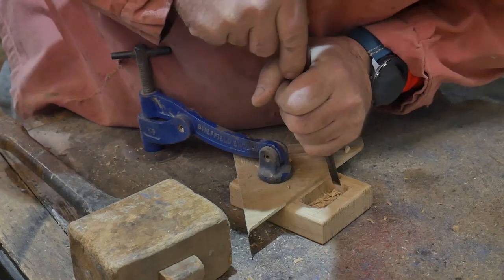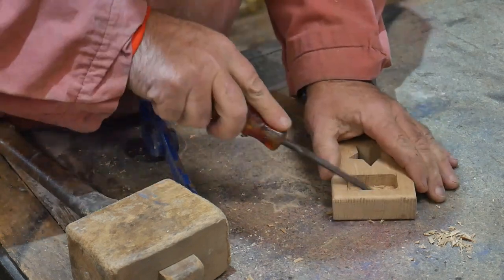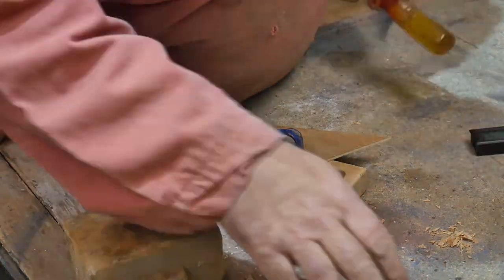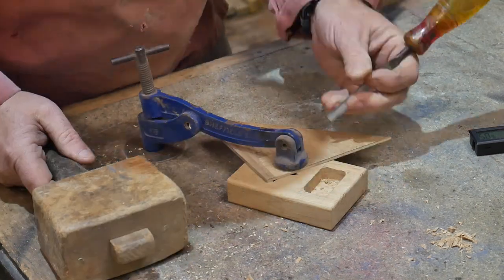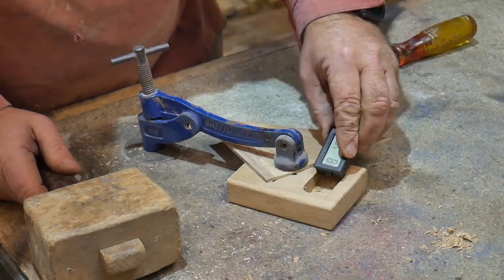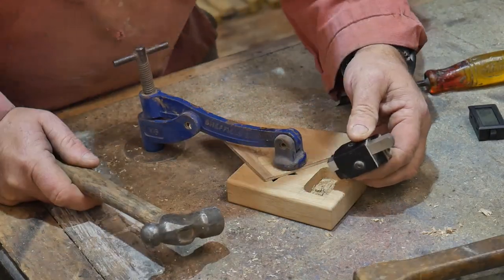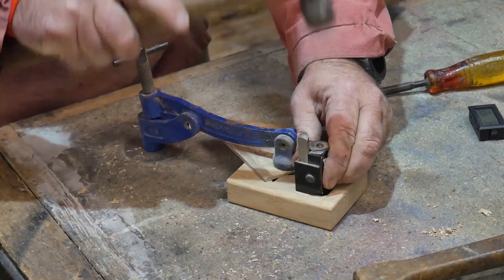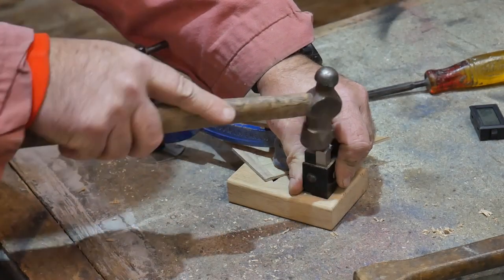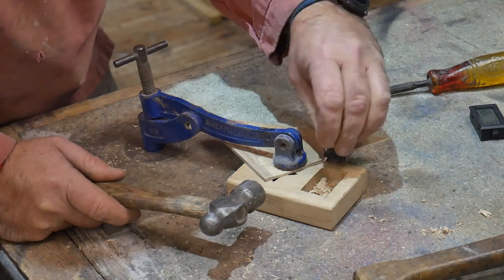That's the first stage of making clearance for the thermometer. We clean the bottom out a little bit so there's no bits in the way. It doesn't fit yet - because the corners are round. So we chisel a bit more and clean it out to make sure there's enough clearance around the thermometer - it was a little bit on the tight side. There we go - there's clearance! So we get a square hole from a round hole. We tap the corner chisel down - it's now square on both sides. Like magic!